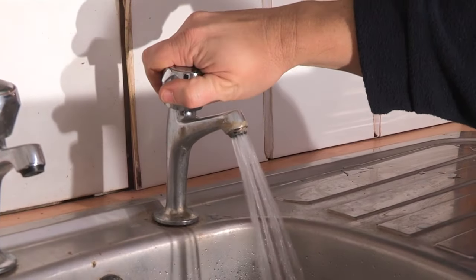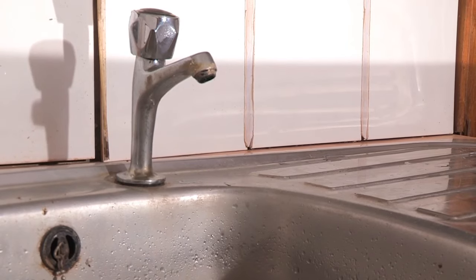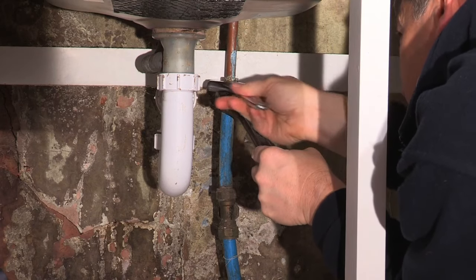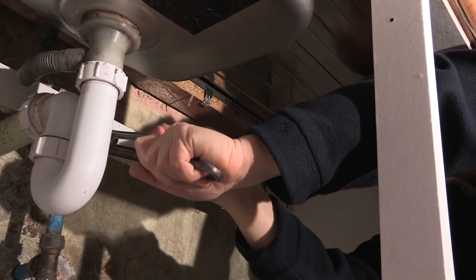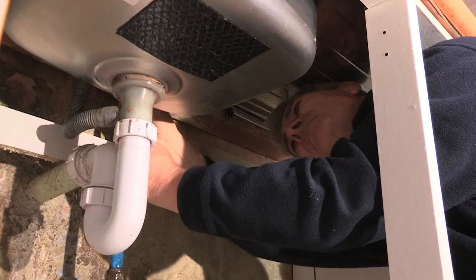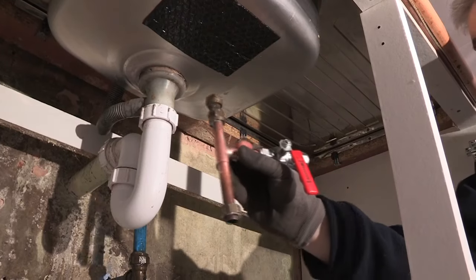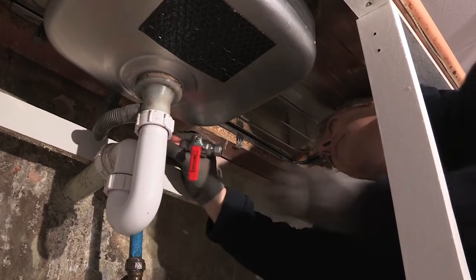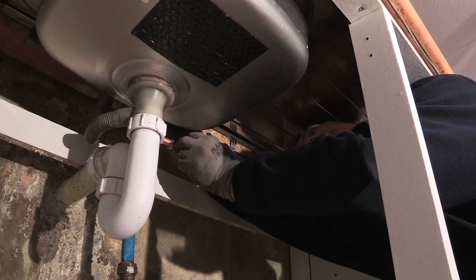After familiarising yourself with the installation book and clearing the site, the first step is to turn off the mains water supply. Next is to T into the water supply for the connection to the Regent water heater. Alan has prepared a new section of pipework with a T and isolation valve. It's important to use a valve that will not prevent reverse flow, such as the ball valve shown here.